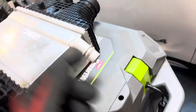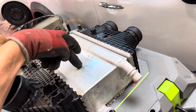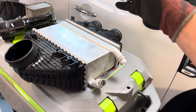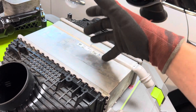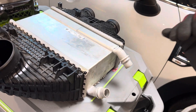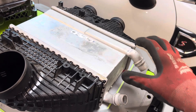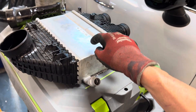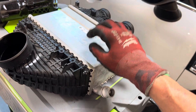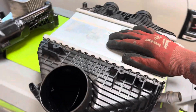Cold air coming out here, this other side going to the compressor — this turbocharger cooler would now become an evaporator and work exactly the same. The problem is when you turn off the engine and pressure goes up, you'd probably go way above what this was designed for. In a hot desert at 115 degrees outside — I was just in a place recently at 110 — under your dash you could be 160 degrees and you would pop this. It was only meant to take water pressure at 12 or 15 psi, and the factory test pressure from BMW is only 21 psi.